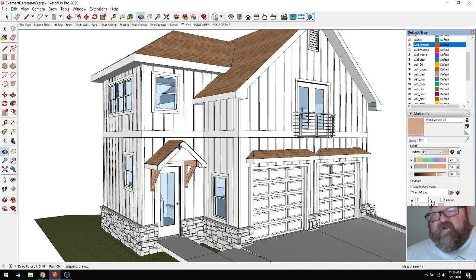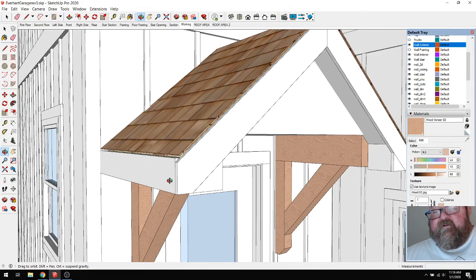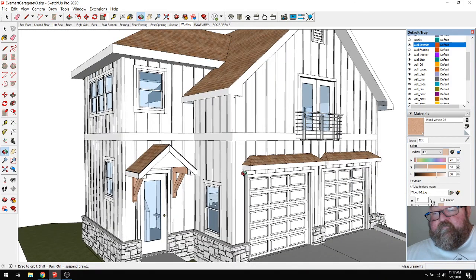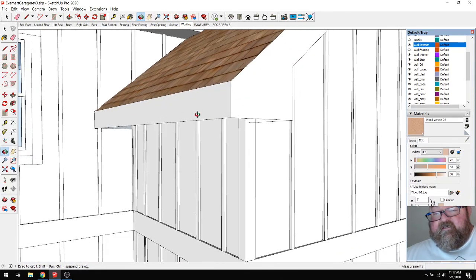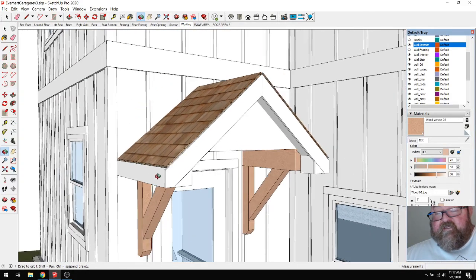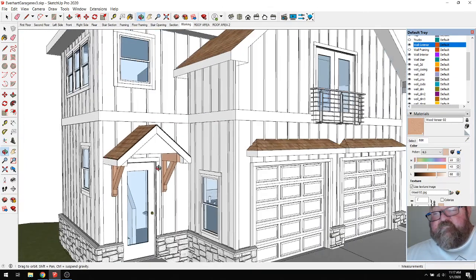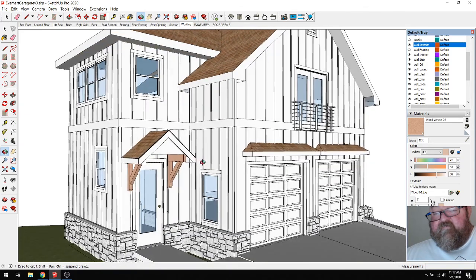And I mean like rafter by rafter, piece by piece. You wouldn't have this little funky situation here. It would just look more real. You see these corners up here, how they're nice and clean. That's how we build things. We don't build them with these weird edges showing like that. And you don't see these lines and that kind of stuff. So I would go back and clean it up and then go for final approval.